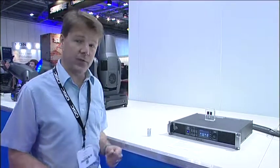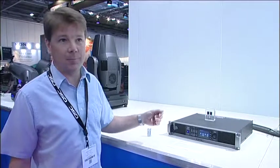On top of that, with the very high voltage rails available in this device due to an incredibly robust power supply — as you would expect from QSC — we can actually drive 100 volts directly from the amplifier, or 70 volts if you're in the United States. So that means on the four channels we could have, for example, one channel with 100 volts, another one on its own in low impedance, and then the other two channels combined in bridge or summed.